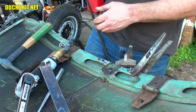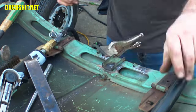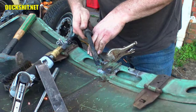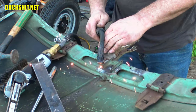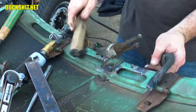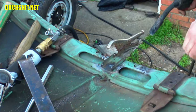Go real slow here or you will burn through — this is very, very thin sheet metal. I just got told on Instagram today that you can't weld with flux core on metal that's really thin, especially on a higher amperage welder. This is a Lincoln 140 and people are telling me that's too much power, you're gonna burn through. Well, you just shorten your trigger pull. You let the glow disappear completely before you hit it again. Got my wire speed and my amperage dialed back — looks pretty effective to me, guys. I don't know what the hell you think is not possible.